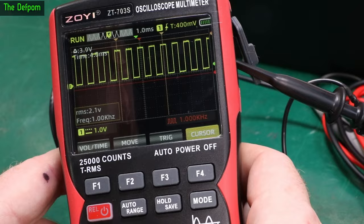Let's check the bandwidth. I've connected my signal generator to channel 1 putting out 100 kHz at 100 millivolts. The auto-ranging earlier had set it to 100 V, so I'm bringing that down. I'm also trying to install a Tektronix inline 50-ohm terminator, but again it can't fully lock onto the BNC connector due to the plastic — which comes back to that connector design issue. They need to get rid of that plastic so connectors can lock on properly.